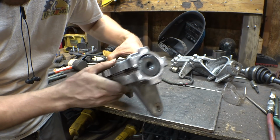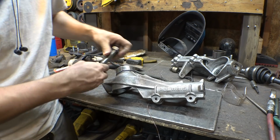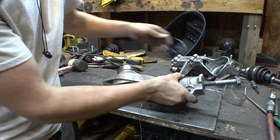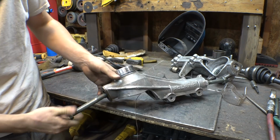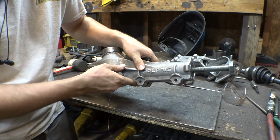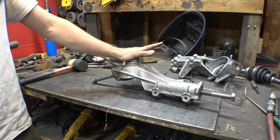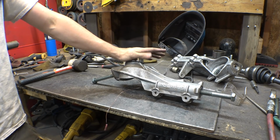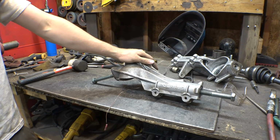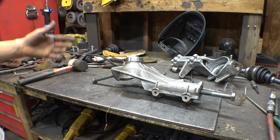So basically, all that did was mean that I can put bolts in the top and bottom of this thing, just like this. So I can thread bolts into here, and therefore I can bolt on the Heim joints on the top and bottom of this thing. Now, something I realized is the Heim joints that I ordered, which still haven't gotten here yet, unfortunately, don't come with spacers. So I guess I'm making spacers from scratch. It shouldn't be too hard. I only need 8 of them.